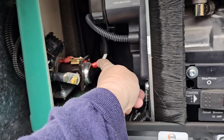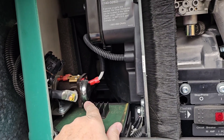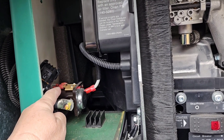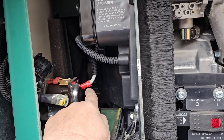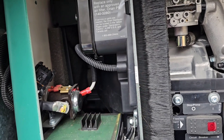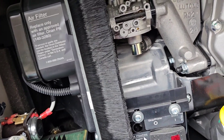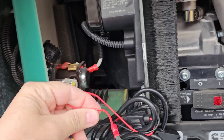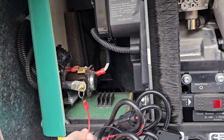The generator picks up the power from the other side. What happens is when you go to your panel to try to start the generator, it sends an ignition signal to one of these little switches, closing the circuit so the generator can use your battery power to start. I'm going to connect the positive wire by cutting a little section out of it and hooking it to the positive connection on the isolator solenoid.